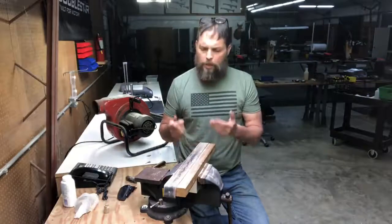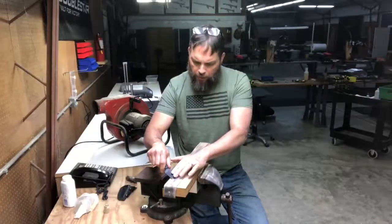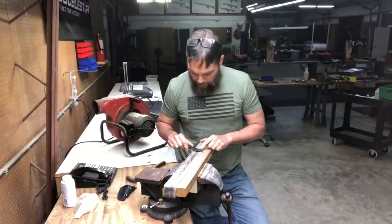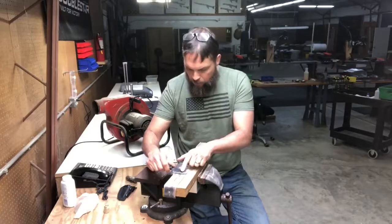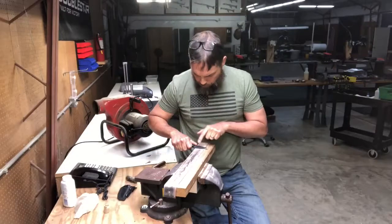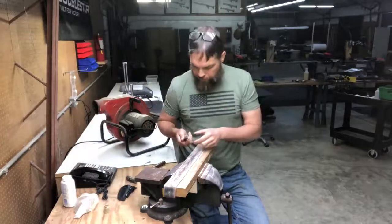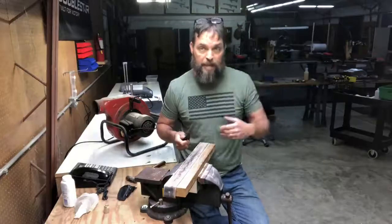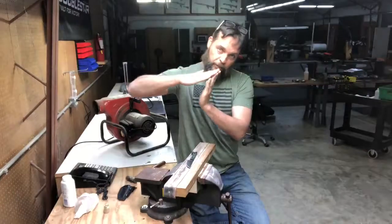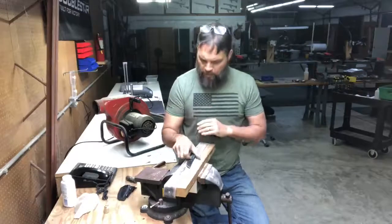Now, with stropping, you want the bevel facing away from you, and you just want to draw it down. What I watch for a lot of times is, as you're pulling, if you've got aggregate on the belt, you'll notice it begins to jump up onto the primary. It'll just hop up on top of it as that edge closes and gets tighter and tighter, and there's not an awful lot there, you'll see the aggregate start to roll up on the edge. That's one thing I look for.